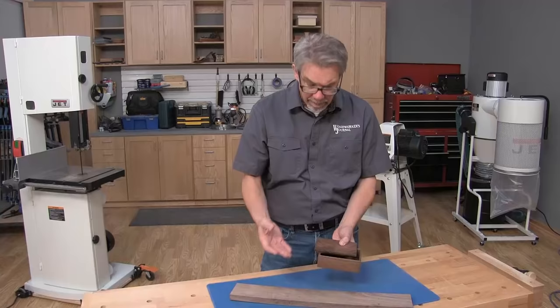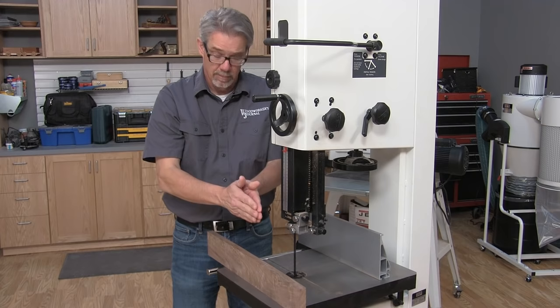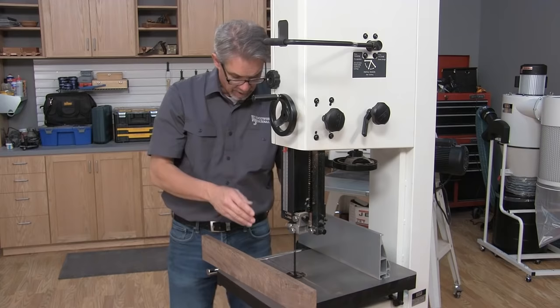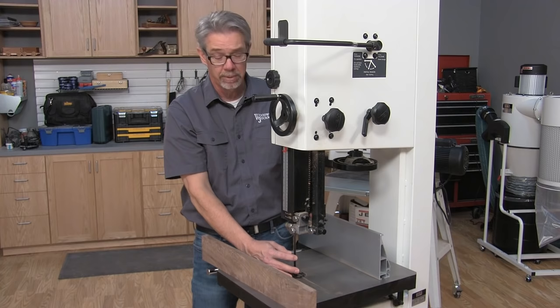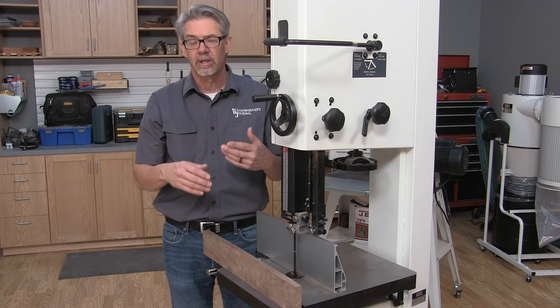How do you achieve those things? We do it by re-sawing on the band saw. Re-sawing is simply cutting a piece of wood in half the skinny way, so you're getting two thinner pieces of wood. It's best to do it on a band saw equipped with a blade that's wide enough for the task — here we have a half inch wide blade, but wider is always better. We also need a fence to guide it as we're cutting the pieces in two. We did an in-depth video on re-sawing that you can find in the video links in the description below.